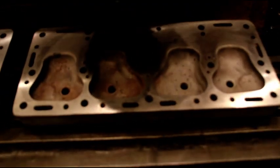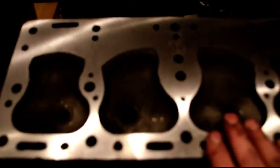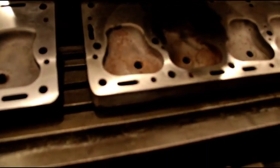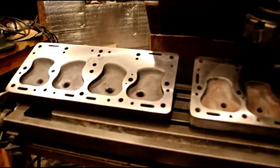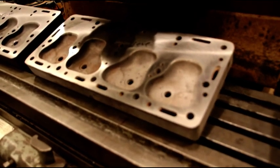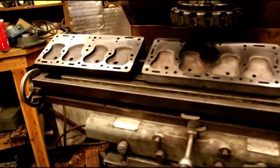All three heads are finished — there's Tom's, Steve's in the center, and Mark's on the end. Mark took about nine thousandths to get cleaned up, but I'm very happy with how that came out — it'll be a very good cylinder head for him. Steve and Tom took a little bit less, and the finish came out just as nice. We'll get these bagged up so they don't get any flash rust. Next we'll get the engine blocks on the mill, get those decked, then we can start assembly. The MB engine is already sleeved with bored pistons fitted, so that one's further along. Mark and Tom will get their blocks decked and then we'll begin the boring process. Thanks for watching everybody — we'll catch you on the next one.